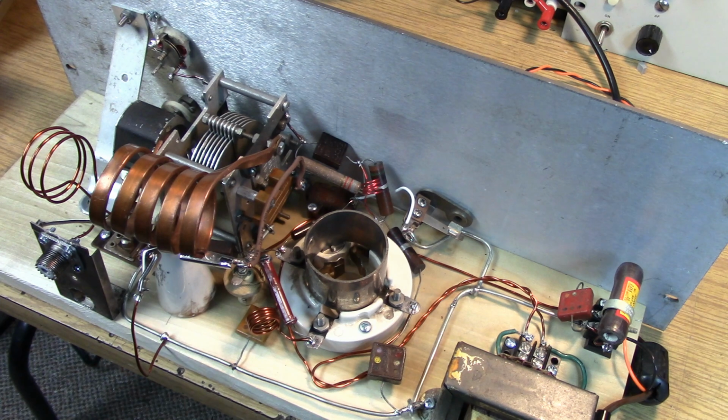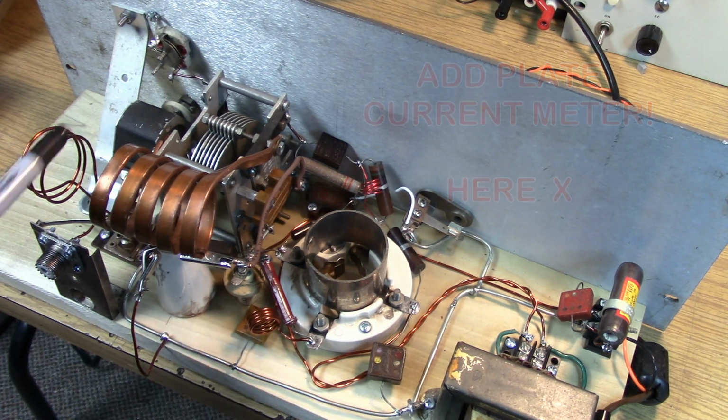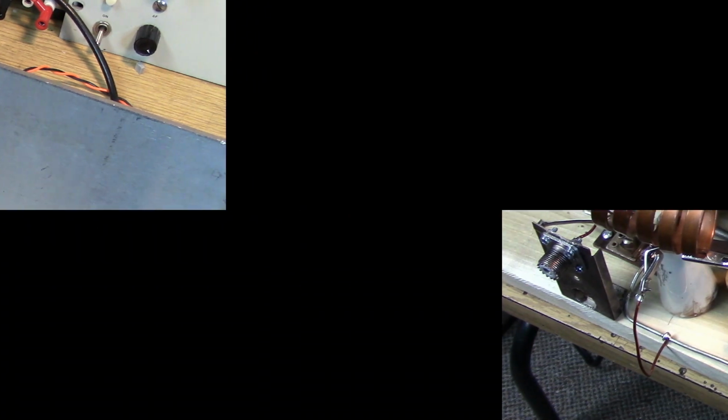So if I went very close coupling, I could get over 10 watts out of this oscillator and the current would go out of sight. By loose coupling, bringing it down to 5, 6, 7 watts instead of 12 watts, the note does improve markedly. So loose coupling on 20 meters means really loose compared to what you're used to on the lower frequency transmitters.